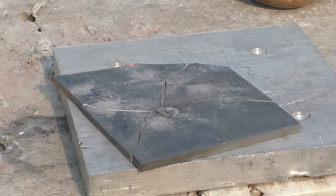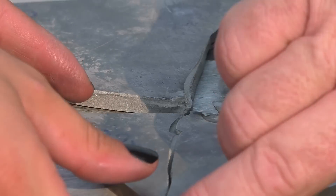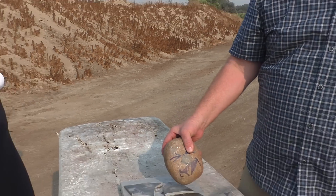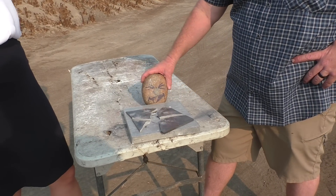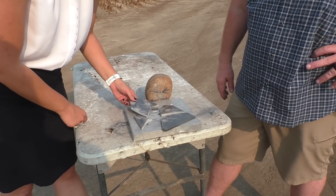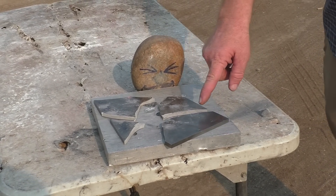That one did the most damage — it actually left a little bit of a dent this time. It blew apart into pieces — it's sharp. What's cool is that piece got thrown about 25 feet back and landed against the berm. It's cracked here — there's a hairline fracture there and a hairline fracture here. It technically stopped all of the round but broke in the process, dumping all its energy by the time it cracked. As body armor, it would be very heavy and would bankrupt you — probably $10,000 or more — and AR500 would be lighter, cheaper, and not as brittle. This has shattered every time, so it is a brittle metal when it's in a thin form.